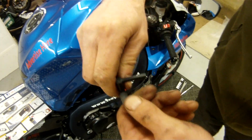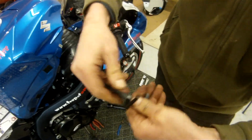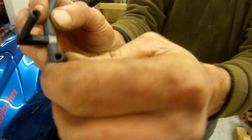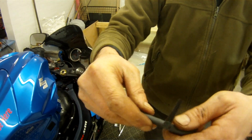This is me telling you just after I've been briefed by Mooley, like I know what I'm talking about. So squeeze both ends on, and then there's a little L section that you just squeeze onto the T-piece. Make sure you get it lined up so you don't end up with the vacuum hose twisted. That affects your throttle bodies and the response from the throttle to the ECU.